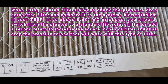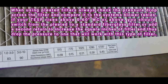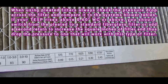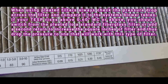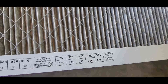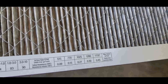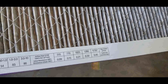You do a pre and post and you can show them how much. If you do the static pressure with this filter in, then take it out and do it without, you can show the customer the airflow. Just pull up the charts on that particular unit — say, if the static pressure went to 0.9 with this filter in, you could show them their airflow would be like 1000 CFM or less, which means it's running like a two-and-a-half ton as opposed to three tons. She says she's not getting the cooling out of it.